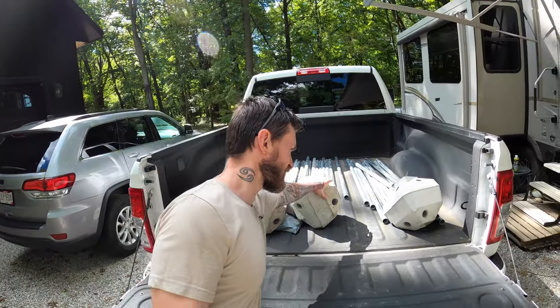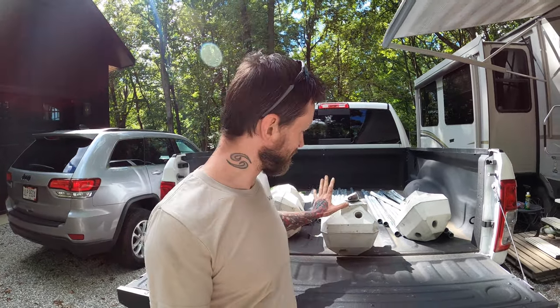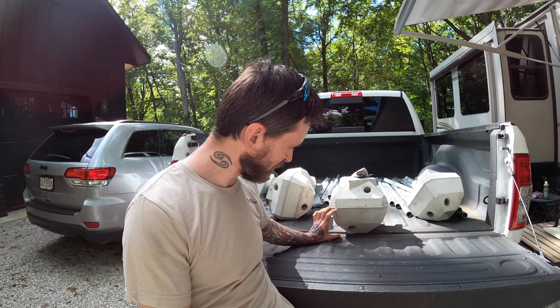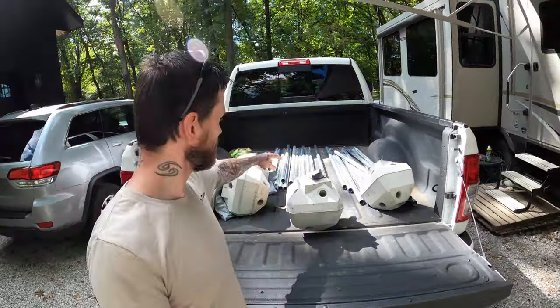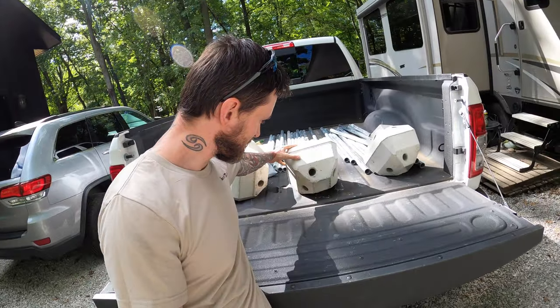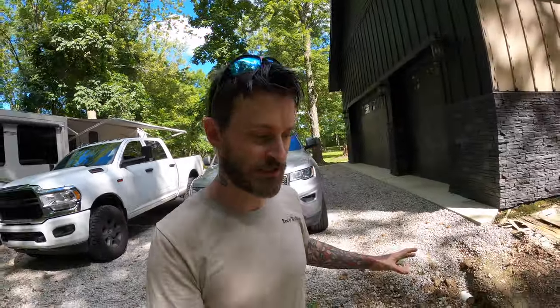Basically, that's what they are. They're just solid blocks of concrete. They're kind of in the shape of a diamond. And the point is, these basically only have to sit almost on the surface. You only have to go down on these particular ones about 5-6 inches of dirt removal. And once you set the pins down going in through each side and going out the bottom, as you can see down through there, all four of them go out almost like a pyramid pattern. Once those are set, you're done. Literally within like 5 to 10 minutes, you can have a pier placed, set your wooden post on it, and you can already start building.